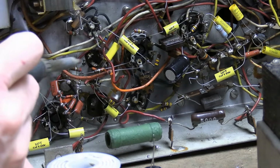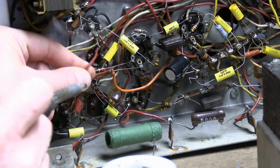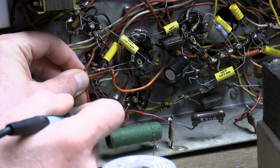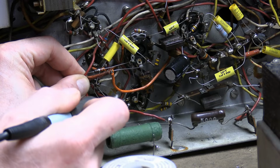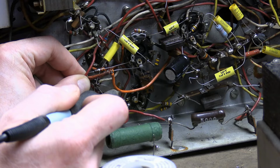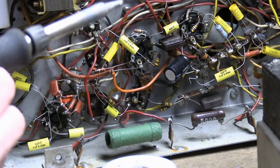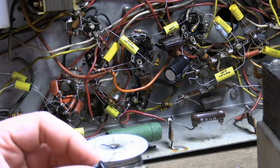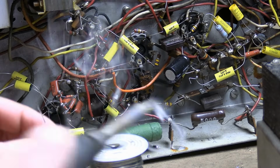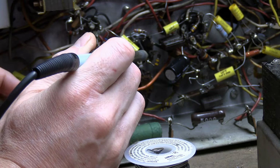I clipped out the resistor lead and the wire, stripped the ends off, and now I'm tinning them so I can tack them together. By tinning I mean heating up and putting a little bit of fresh solder on them. If you don't tin the ends, it's hard to get them to get together, especially when you only have 2 hands to work with. And of course, when I put this third lead on, those 2 may come apart, but if I'm quick and I'm lucky, they won't. Or again, I could use alligator clips and test leads. I need to ground this somewhere too.